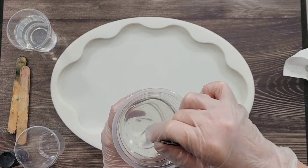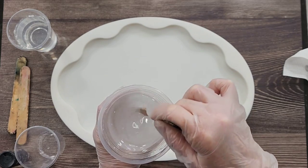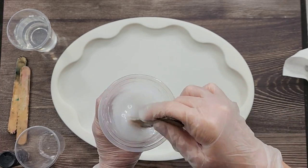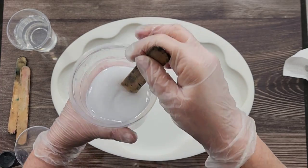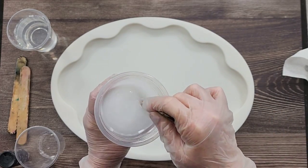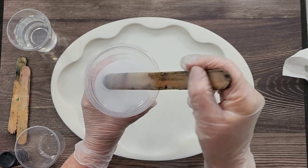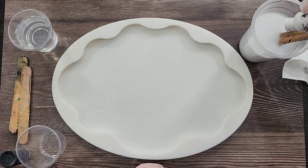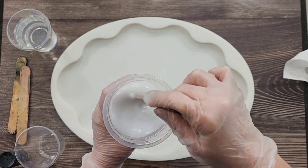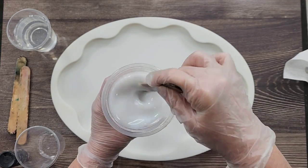I'm using the Platinum 360 Plus and I've mixed up two cups, 500 grams. I don't want this opaque but I don't want it too clear-looking either. So that's probably a little bit too transparent - we'll go one more drop, just starting slowly here. One more drop - they're big drops. Any white pigment paste will work. I think it's sometimes just easier using something that just drops in. Let's mix that up.